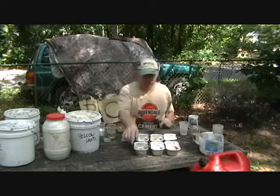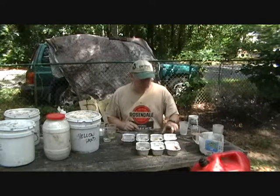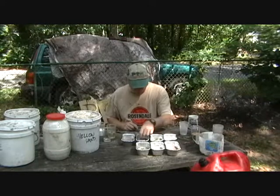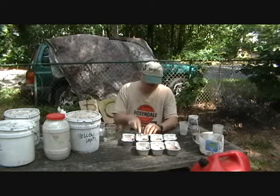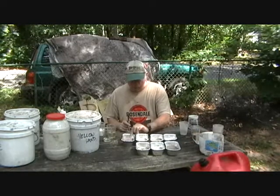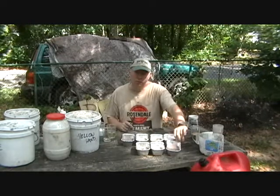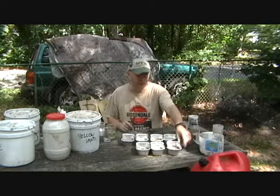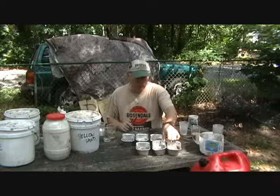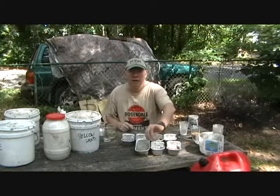And there we have it. Our test sample of sand with lime and gray Portland, grape nuts with lime and gray Portland, 100% grape nuts. White marble dust with gray Portland and lime. The really nice brownstone composite patch material, and the brownstone composite patch material mixed 50% with grape nuts. And sand, grape nuts, 50-50 with lime and gray Portland. And the sand, grape nuts, 50-50 with gray Portland and lime and gasoline.